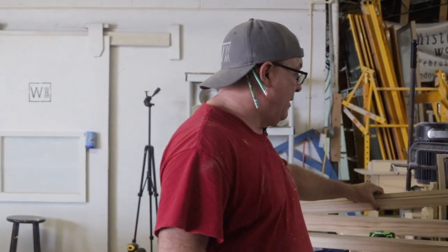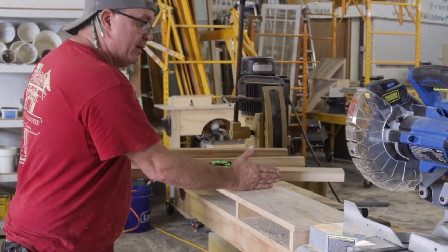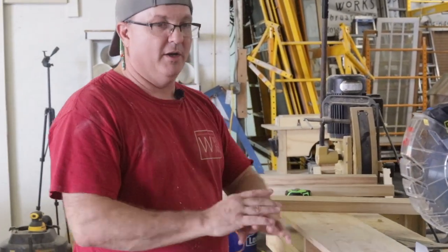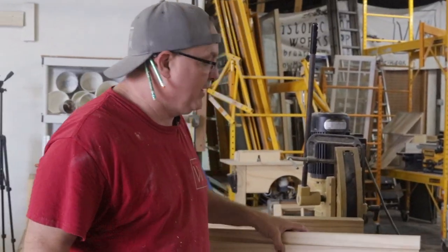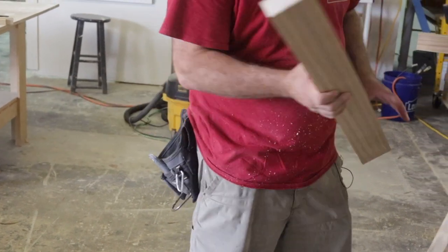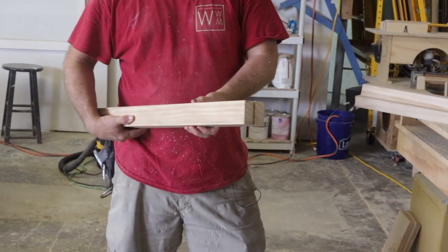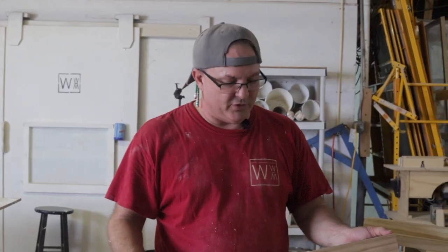For the second piece, I didn't even measure — because I'm a cheater. When I cut my first one, I kept my piece right there, came over, made a mark where it stopped, then just put my next piece there and made a cut. Little tricks like that make it fun. So now I've got my rails and my stiles — these are fully loaded blanks. At this point you divide the work up.